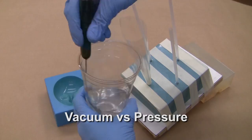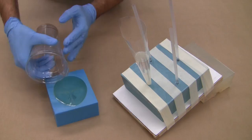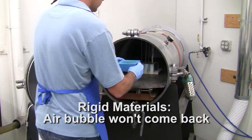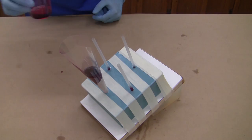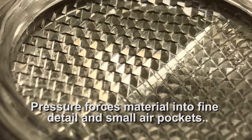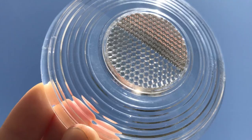Now back to the topic of vacuum versus pressure. It's good to understand why you might want to use vacuum degassing in the casting process versus just using pressure. Vacuum physically removes air bubbles, while pressure simply squeezes the bubbles down to a less visible state but technically doesn't eliminate the air. On rigid materials, the bubbles don't come back. On flexible materials like silicone and urethane rubber, the bubble can actually rebound, causing deformities in your molds or parts. If you vacuum degas the material, pressure casting is used as an insurance policy to catch any incidental air bubbles produced as the material flows through the mold, or to force material into extremely fine detail or small air pockets that can trap air. Pressure alone doesn't always get 100% of the air bubbles, but on some castings you might get away with it. Either way, it's good to know how and when to use both techniques.